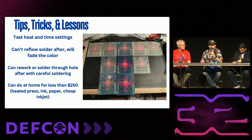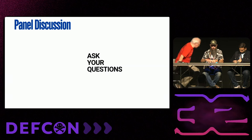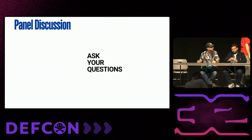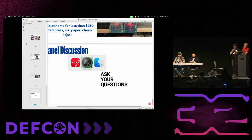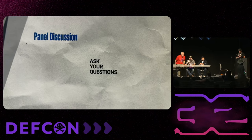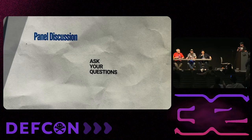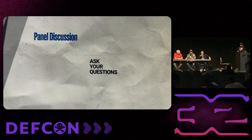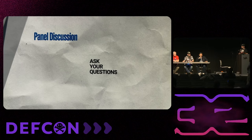This is formatted as a panel, so if anyone has questions please come form a line. A question for Panda: how long does it take to fully color one batch? Depending on how you place the PCBs on the bed, for me it takes about a minute if I use the entire bed — two feet by three feet — or about one and a half minutes if using maybe half the bed.